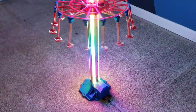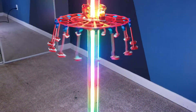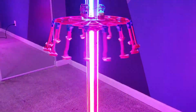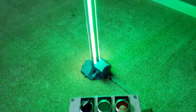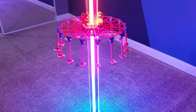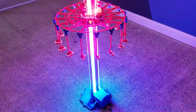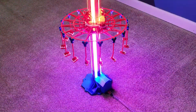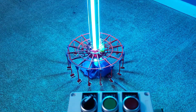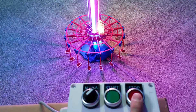Now that I'm running, I can do a couple different things. I can stop the ride, which is considered a ride stop. What that's going to do is stop the carousel, stop the elevator, and bring the ride back down to the home position in a controlled fashion. So I'm going to do that right now — hit ride stop, stop the elevator, stop the carousel, and now we're going to go back home. So that's simulated a ride stop, and from there we can immediately start back up because it was an operator-induced stop.